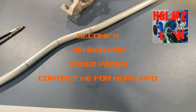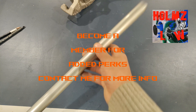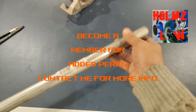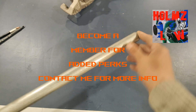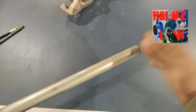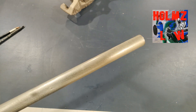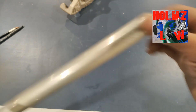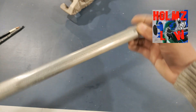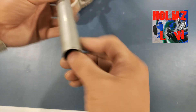So let's go ahead and talk about how to stop dogging your conduit. Basically you have this EMT, and whether it's EMT, aluminum rigid, or regular galvanized rigid — they all have this issue. What I'm talking about is they have like a seam inside of these conduits. EMT is very infamous for this.